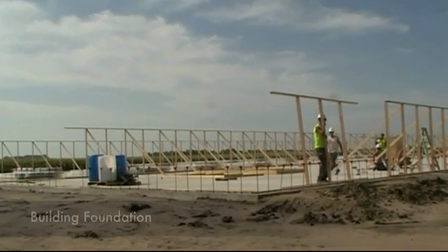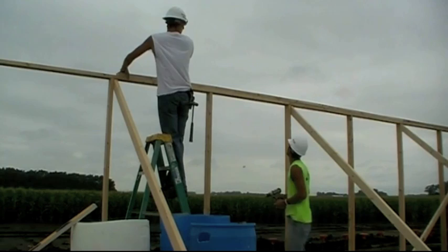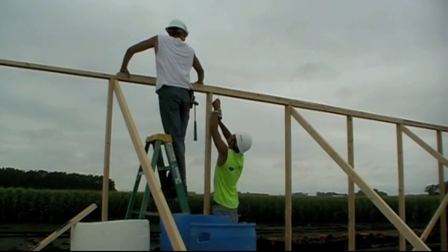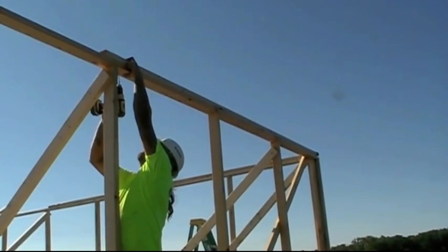When setting up the bracing, make sure the braces are set up square and level, as this will reflect in the walls. Bracing the walls can be built with wood, steel frame, tube and clamp, and ICF bracing. To determine the best method for the job, verify the local safety code, consider the height of the walls, and understand the local weather.